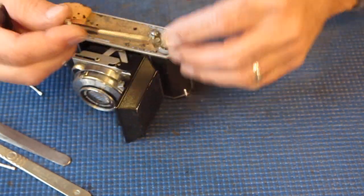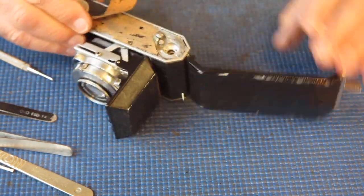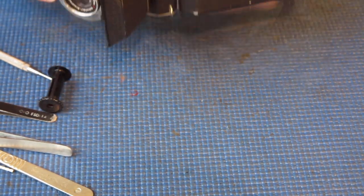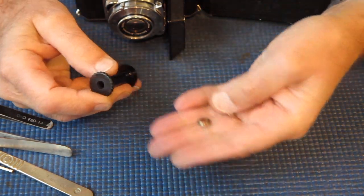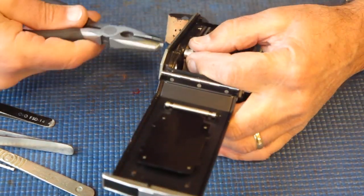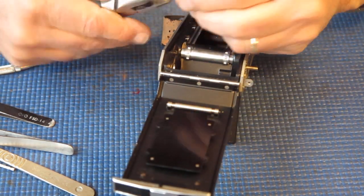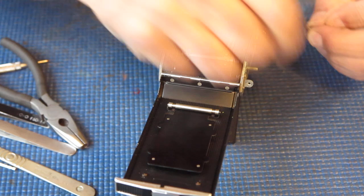I can hold back that tab, lift the shaft out — that's quite clean actually. I was expecting to see sticky dried grease on there but that wasn't the case. I can take out the take-up spool — that's quite clean — there's the metal bush from the base of it, again that's relatively clean. The rewind button needs to come off, so I'll remove the rewind button with special pliers there, modified to do the job.